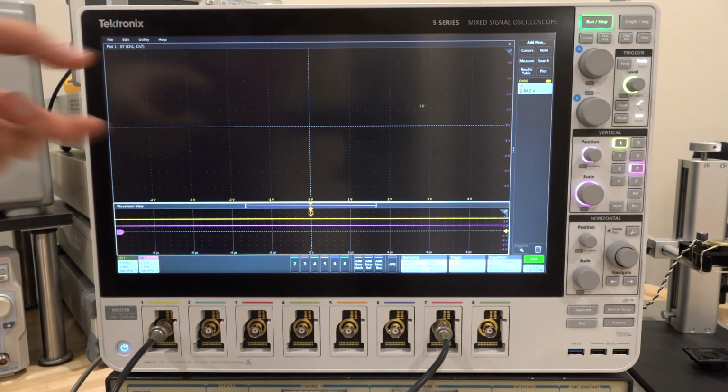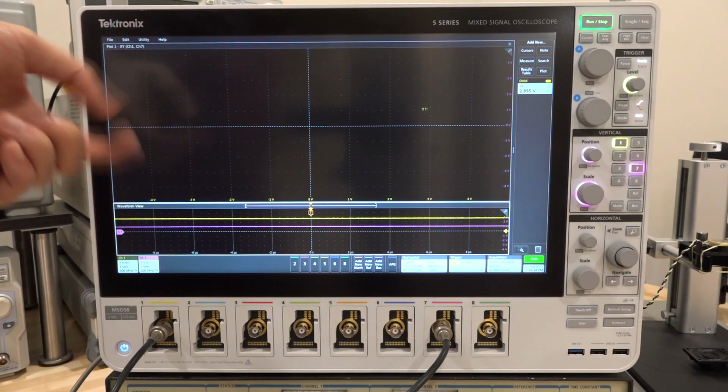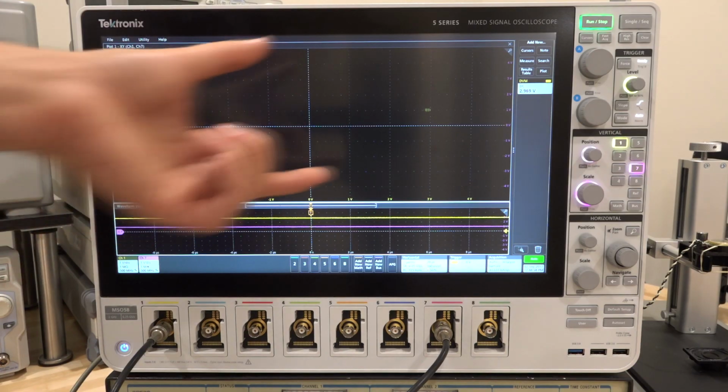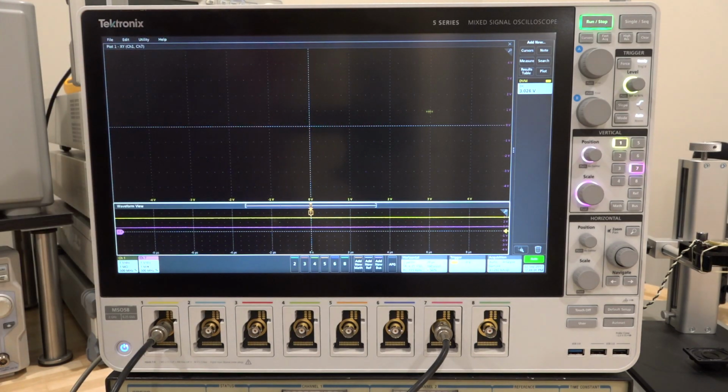There's another reason, because as I change the distance between the two speakers, the received signal strength in the top speaker is going to go down because we know that the signal attenuates as a square of the distance between the 2 points, and therefore the signal is going to get weaker, so this point wants to move closer to the origin.